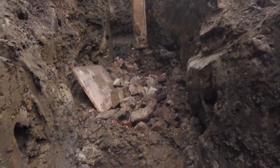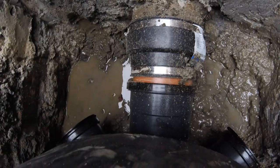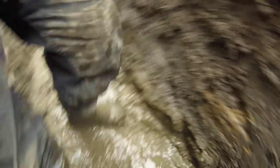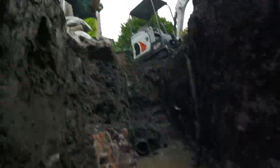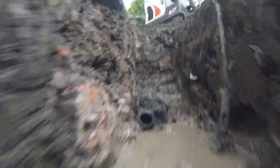The manhole is nearly broken out now. On this side we've got a balloon in to stop the water. We're going to break this bit of pipe out and pull the manhole out. That's our connection done with our little rocker where the manhole's going. We've got the balloon through — it's ready to let down — and we are aiming from there to that new little bit of pipe to make that connection.